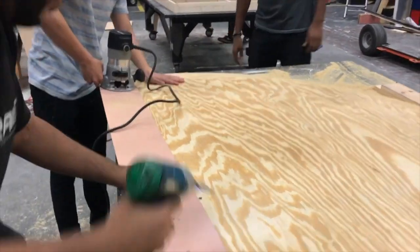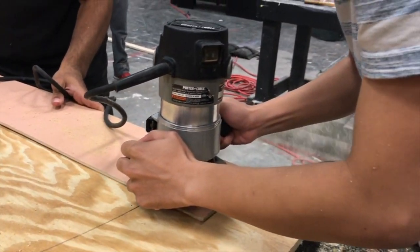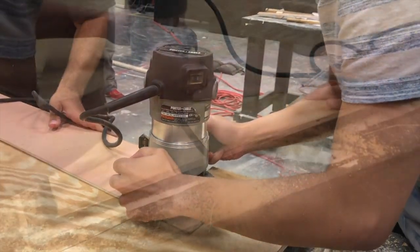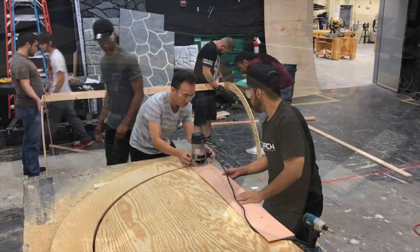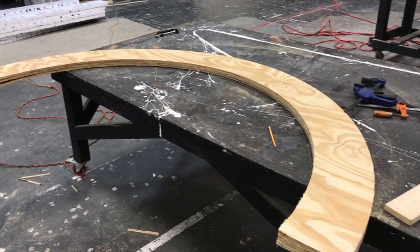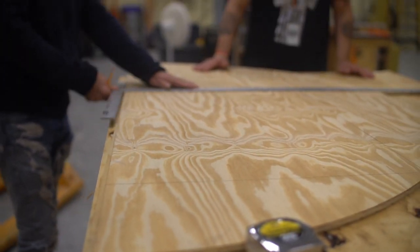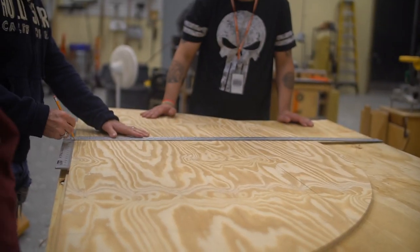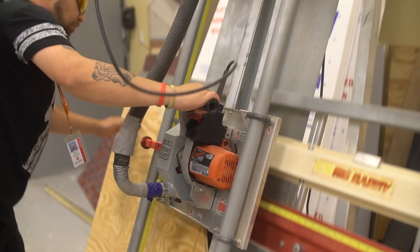What they're doing now is shifting the screw into the other hole, making the jig a little bit shorter, and we're going to make another pass — that's going to give us our interior cut of the well. You want to move rather slow and let the router do the work. You also want to hold down that piece of plywood that the router is held onto. If it chatters or if you push too hard you're not going to get a perfect arc. As you can see it gives us two nice great arcs. I'm going to use the leftover wood from the arc to cut out some parts that are actually going to hold the two pieces of arc together.